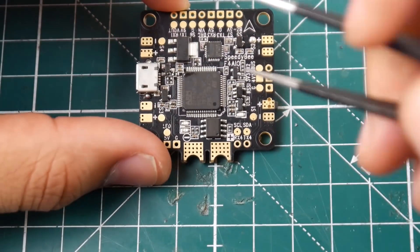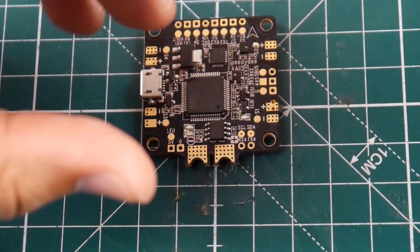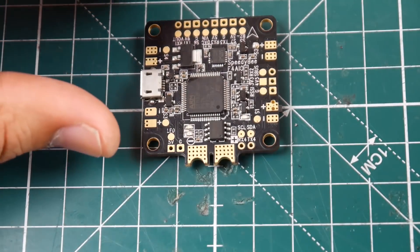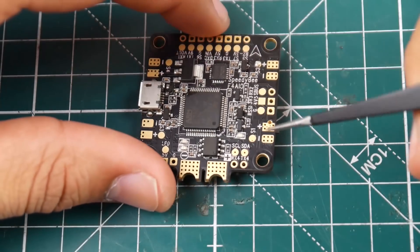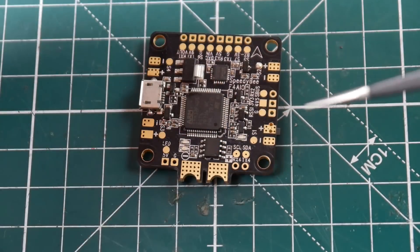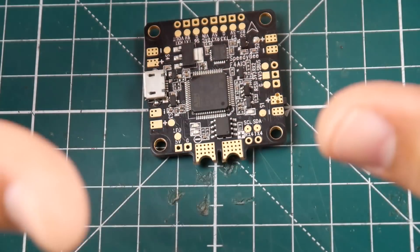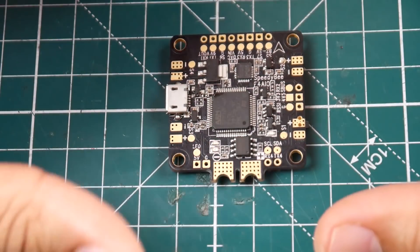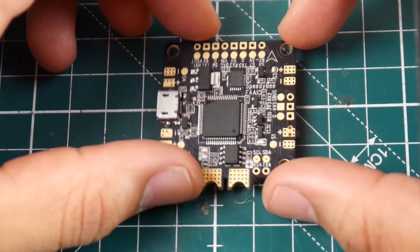I highly recommend that from now on you ground your ESC signal. I used to say there's never a need to ground it since the whole thing is grounded anyway, but it does create issues — I've seen it on my four-motor testing setup. Take the signal ground from your ESC and tie it together with the ESC power ground in the same place. You have no idea what kind of issues it causes. I'm still working on a video showing examples of the difference, and testing through an oscilloscope.